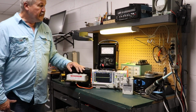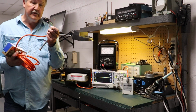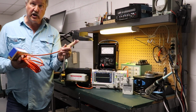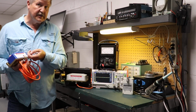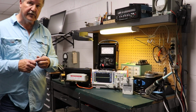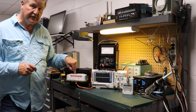Basically, you take that R58 device, and it has color-coded clip leads. You connect those 4 color-coded clip leads to their matching pairs here on the sensor at the junction box, for example. And then you make sure the internal equipment that it communicates with is disconnected. So you, for example, open the test links or gold nuts or disconnect from the field, so that this is the only thing connected to the sensor.